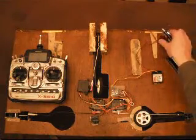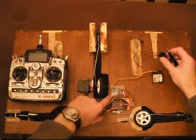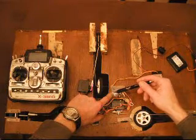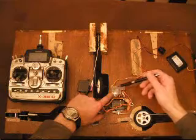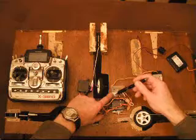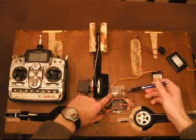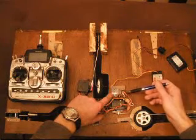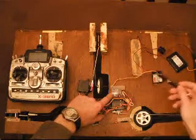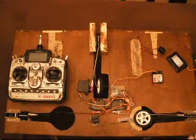The first thing I'm going to do is just reset the device to ensure it's in default settings. On the device, there's a little micro switch here, and a buzzer that tells you where you are in the setup routine. There's a little trim pot here for making travel adjustments, and there are six servo outputs — the first three are for the doors, and the second three are for the legs. It actually only takes one channel from the receiver — channel five, which is typically undercarriage — so all the mixing is done from that one switch.